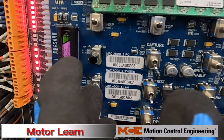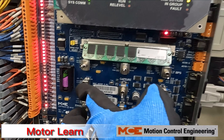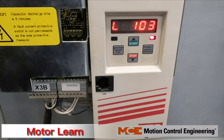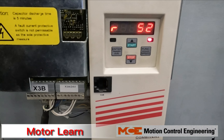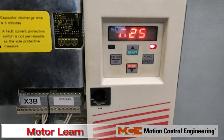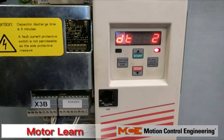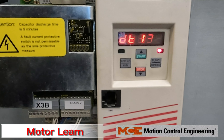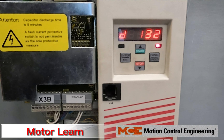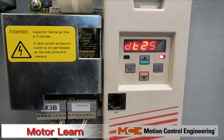You're going to want to hold Enable and Up, or Enable and Down, to run the motor tune. One thing to keep in mind: if you have a permanent magnet gearless machine, after your S-Learn you're going to want to do an SPI learn as well.